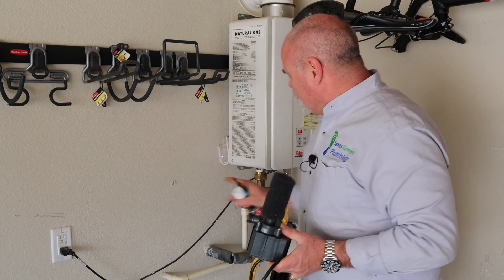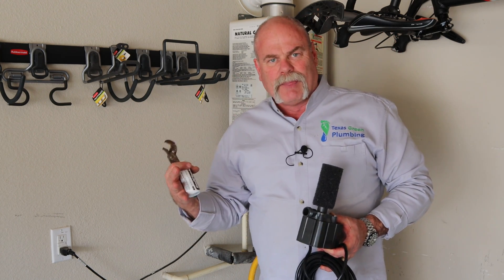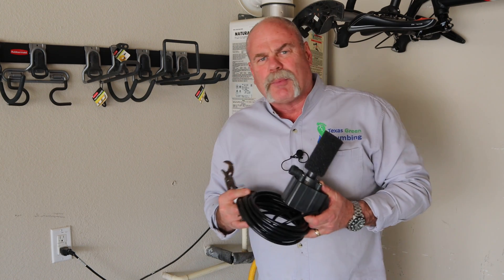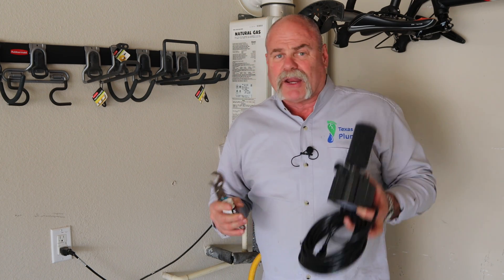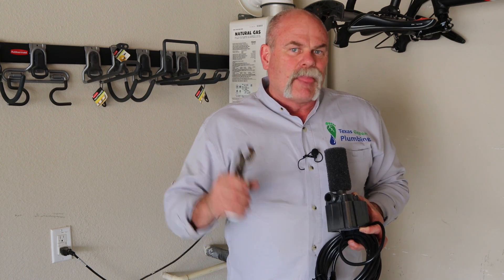The only other tool that you're going to need is a circulation pump. What this is for: you're going to have to shut off the water to the water heater to isolate it, then you've got an inlet and an outlet, and you need something to circulate that fluid through it. They make kits that they sell — we're using a Haymaker product today and they've got a good pump that comes with it. Once you buy this, you can either reorder the chemical, or I'll give you a trick at the end of the video to show you some tips to use something different to help save you money.